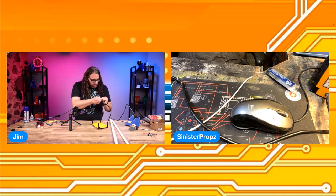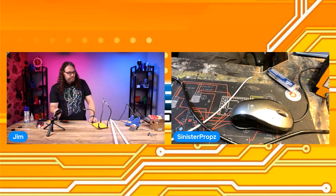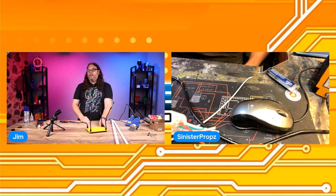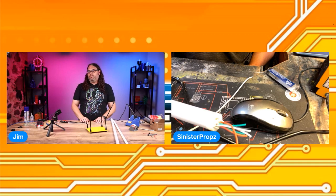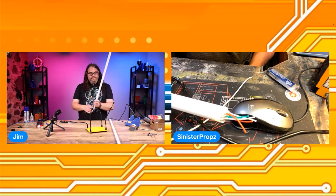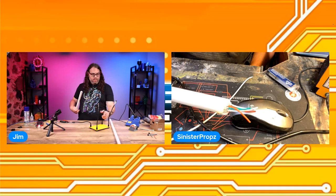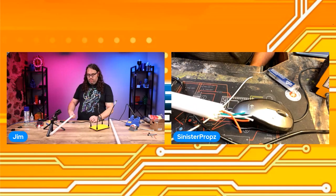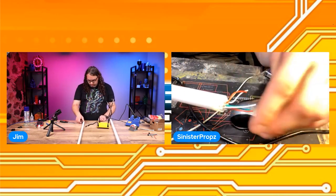And I'm good here. You're good? Yep. Okay. So now what you're going to do is solder those wires to the respective channels. Green is data, remember? Green's data. I have white for the negative, that would be your black, and then red for the positive. Keep in mind, do you realize that they're mirrored? So the green's the center.